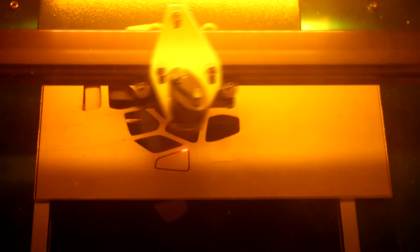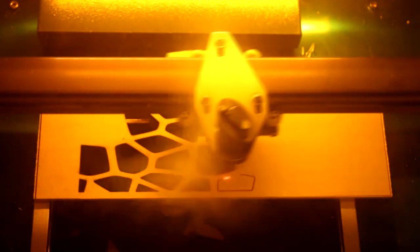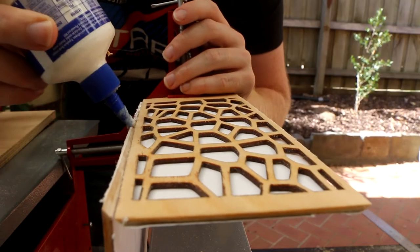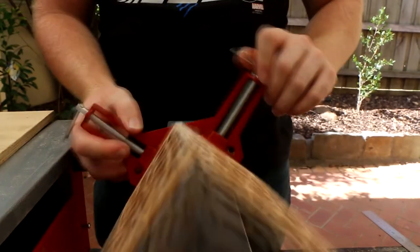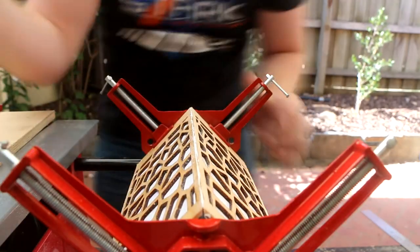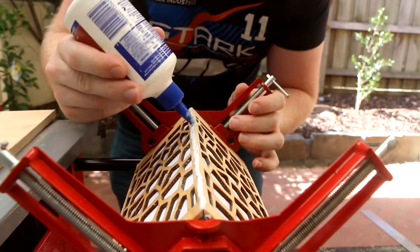To make this I started out by laser cutting some bits of wood that were previously cut to size. I realised I probably should have used the laser to cut the outline of the wood as well, because it cuts much more accurately than I do, and I did have some issues with slightly different sizes in my wood. Next I used the corner clamps again to glue all the edges together — it's much more fiddly with small bits like this, but eventually I got it all lined up and it worked well.